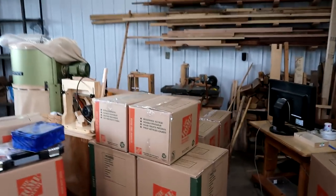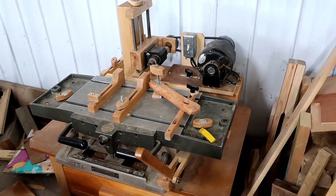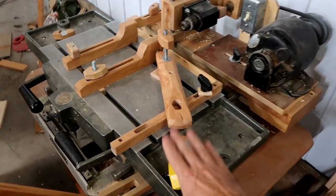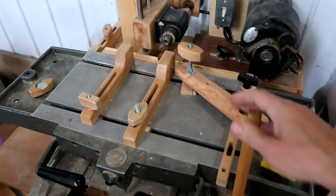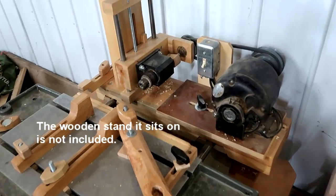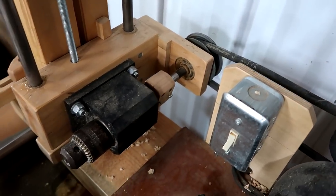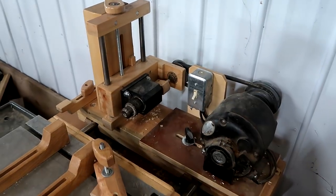Next is my horizontal boring machine. I actually quite like this machine, but it's very heavy so it would cost a lot to move. I've used it very rarely, partially because if I use it in a video, it's not something that's available to other people, because this sort of sliding table — I paid quite a bit for that used — really enables it. This is actually a much sturdier table than you would find on a commercial horizontal boring machine or a slot mortiser. The way this bearing and coupling extend the shaft for a pulley works, but I'm always kind of surprised that it does work and that this doesn't come apart. So I've used the machine without trouble, but that might be a bit of a sneaky problem there.